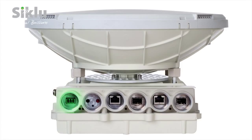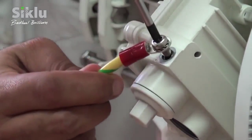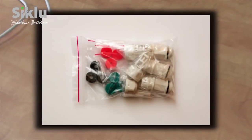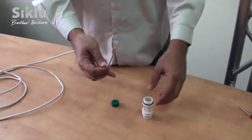Use the port designated PWR to connect the ODU to a DC power supply in the range of 36 to 57 volts. The port designated AUX includes sockets for digital voltmeter probes used during alignment, as well as a reset push button. Two or four active Ethernet interfaces are available depending on the hardware configuration — either electrical RJ45 or optical SFPs. The ODU must be grounded using a copper cable of at least 16 AWG and in accordance with local electrical code. All cables should be outdoor-graded with UV protection. Category 5E or 6 Ethernet cables must be shielded and terminated using metallic RJ45 connectors. Three sets of protective all-weather shells are provided, fitting cables from 3.5 to 9mm in diameter.